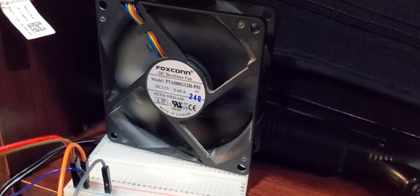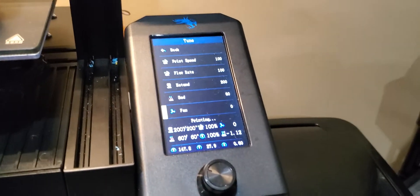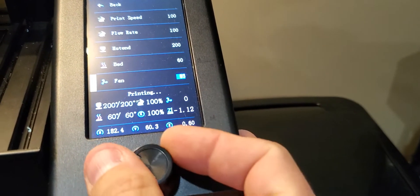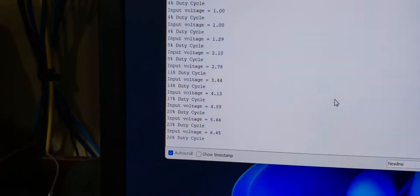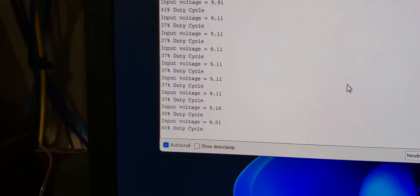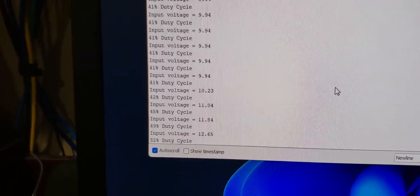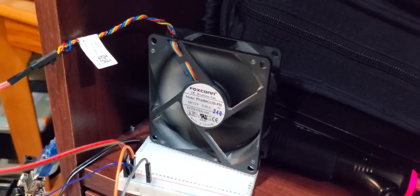You can see this fan here is just basically idling — it's barely moving at all. So now what happens is when your G-code calls for more fan — say for example, after the first layer it'll call for usually around 85 fan, on a scale of 0 to 255. My Arduino is reading that voltage — it reads it 30 times to get an accurate representation. I always find it kind of overshoots a little bit and bounces back; I'm still working on my smoothing algorithm. But 85 is a third of 255, so a third of 24 volts is actually about 8 volts. Right now it's kind of stabilizing and normalizing — eventually it'll settle around 8 volts. But you can hear the fan — it's kind of ramping up the fan speed and it'll smooth out and average out.